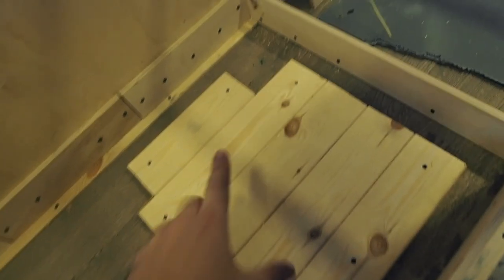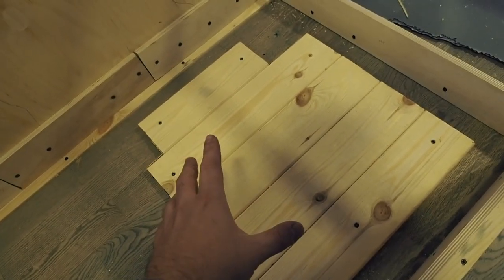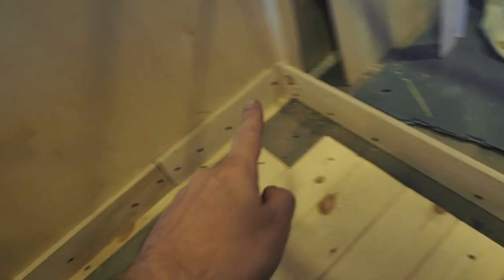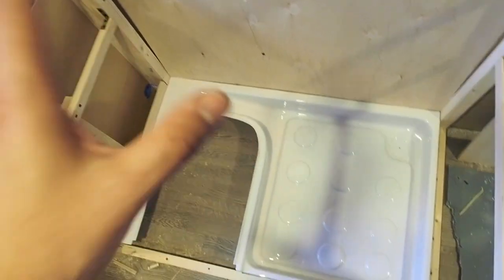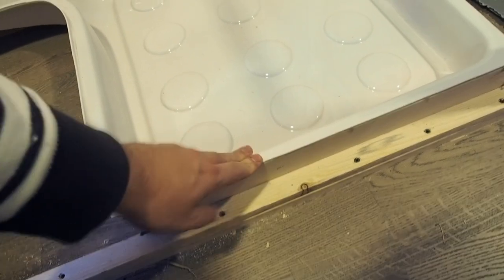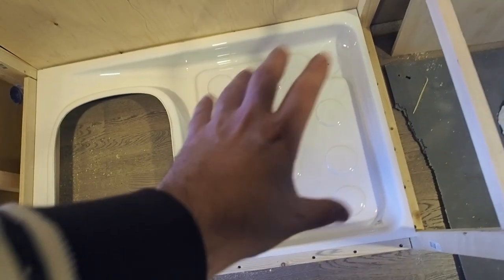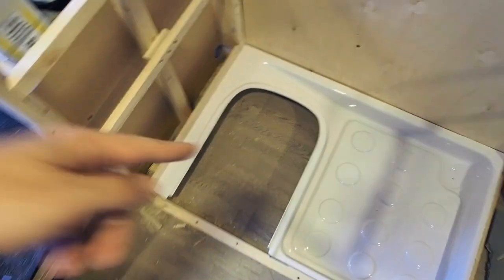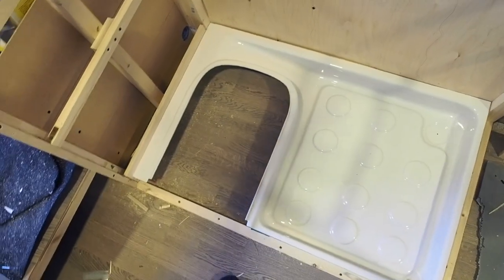At the bottom you can see this piece — it supports the actual shower tray area because it's a little higher than the shower tray frame. And these wooden pieces support the shower tray sides. All the wooden frame of the cabin is built around this shower tray, so it's exactly the size I need. You can see that the shower tray is laying on its plywood wooden supports. This area is supported by its own piece, so it's super strong, not wobbling, not moving. And here you can see the cut-out for the toilet.